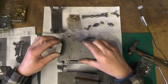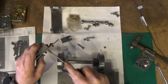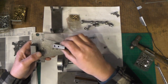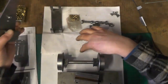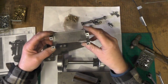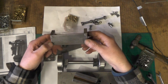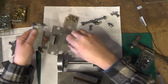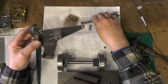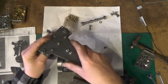Put the bearing block on next — again that's two 4BA screws. Then the control fork goes on next. Then it's the bottom plate, and I've got the horn pillars already attached with four 4BA screws. Then you've got to put your spring housings underneath with the springs in.